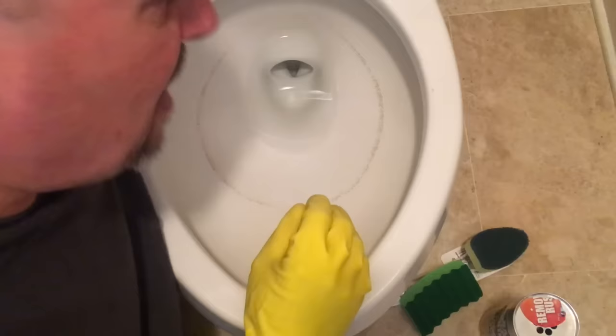So the conclusion is that a toilet ring that keeps coming back, and certainly ones that are coming back more harshly, is probably caused by ceramic pitting found at the waterline of older toilets. Pitting can be caused by hard water, urine, and other bodily waste, but the biggest culprit is Father Time. If your toilet is 10 years or older, you may already have some pitting. The best way to tell is to take a picture at the waterline and then zoom in just like I did.